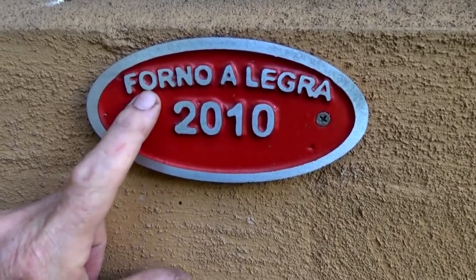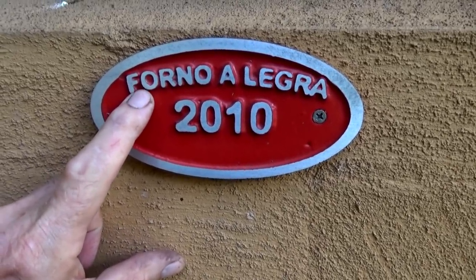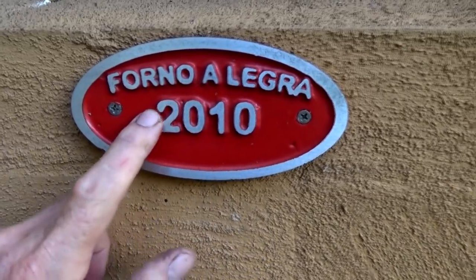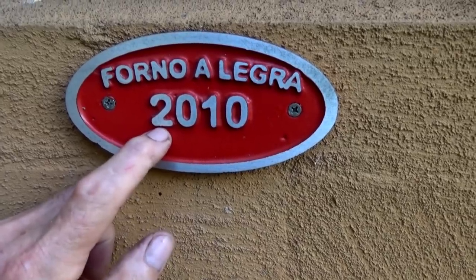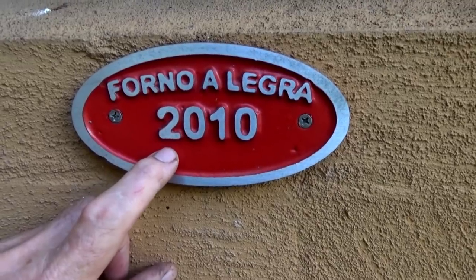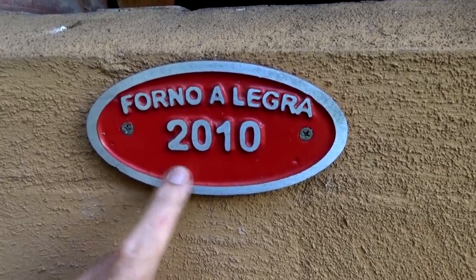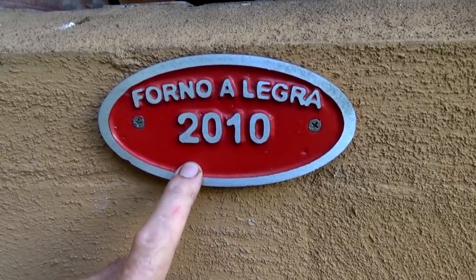I got this to work by filling around the letters with a water-based wood putty, smearing it around and wiping it over with a wet cloth until I had a build-up of putty around all the internal corners. Let that dry, painted it just to seal it, and it worked. This was one of the first castings I did in my home foundry and it's just painted with some red enamel, but one of these days I'll powder coat it properly.